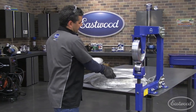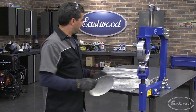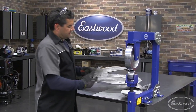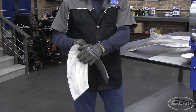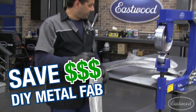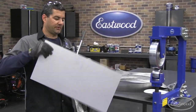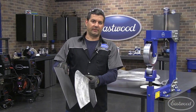The wheel is going to do some stretching. You can shrink with them too. Now this is a bowl that we just whipped up real quick here, but also what we're doing — these are some fender flares we're making right here. So these four of these right here would pay for the cost of an English wheel. What we're going to do is show you in just a couple minutes how we can take this piece of 20 gauge here and turn it into a flare.